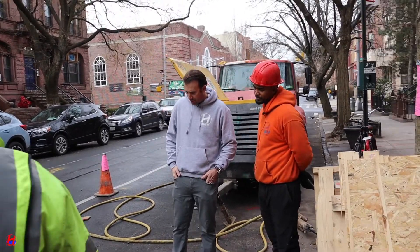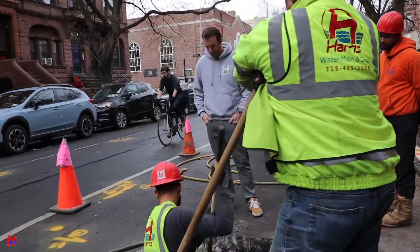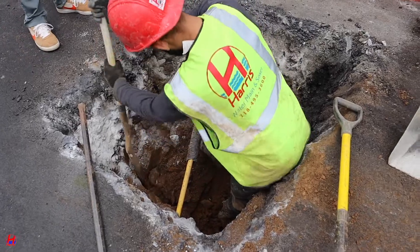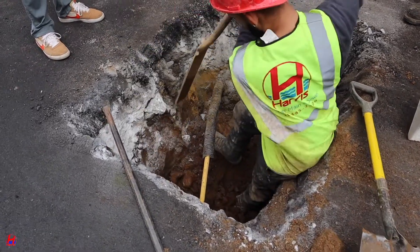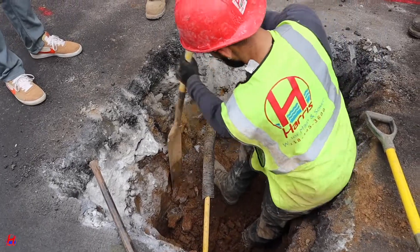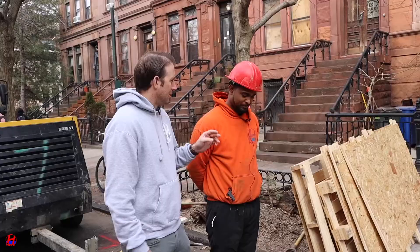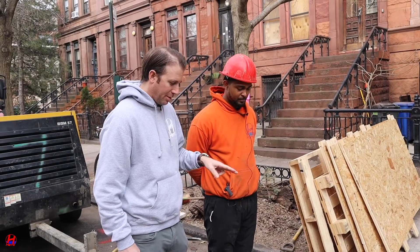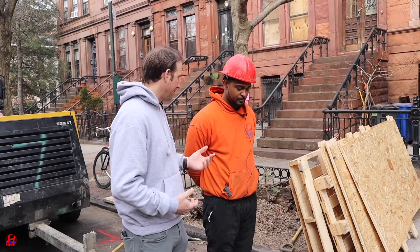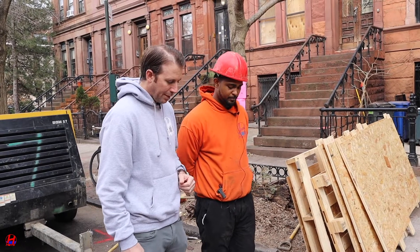It's hard dirt here. The old gas line is there, but they could have capped it from the inside — still could be live, so you can't just blow right through it. We could just cut it out of the way. So we know we have at least one more hole to make, potentially another one on the sidewalk. We're not working on an E-number, so we're capped on our time — we can only work to six o'clock on the street.